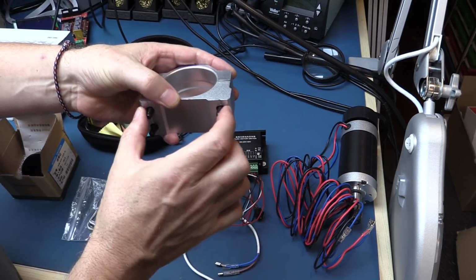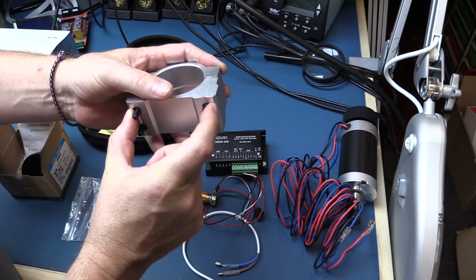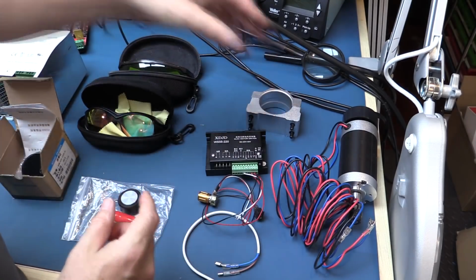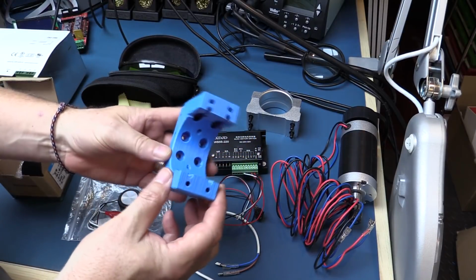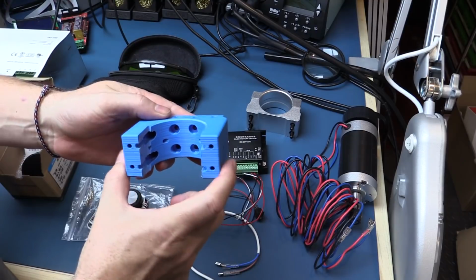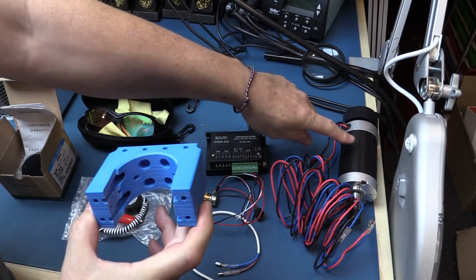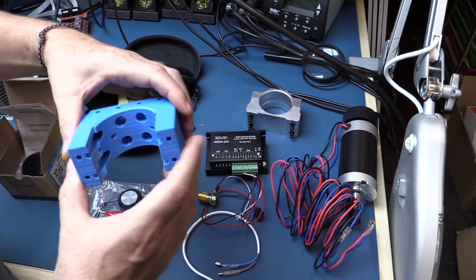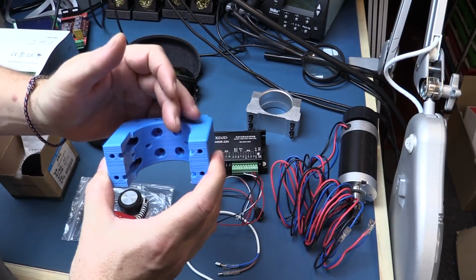Now, as I said, this is more than 80 millimeters across, so it won't fit on my Z-axis. So I'm going to do a 3D printed version with the correct pitch, and I already have one that I've just sort of brutally adapted from a previous design. I adjusted the hole size to 55 millimeters, which is what the shaft has on here, but there is a lip on the top and bottom, and there's not enough flex in this to get the spindle through it and then mounted.